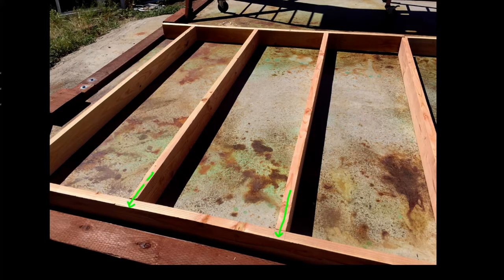In the case of this greenhouse, and in the case of the floor, we were doing 24-inch centers, which is pretty common for advanced framing where you're trying to maximize your use of lumber. Also common is 16-inch centers, and you'll see that a lot in our walls. In addition, let's look at a couple more wall elements here while we have this wall on the floor. Our lumber is 1.5 inches wide, which means we should have 3/4 inch on either side of this to attach our sheathing or our drywall to. So that's 3/4 inch to the center of our wall stud.